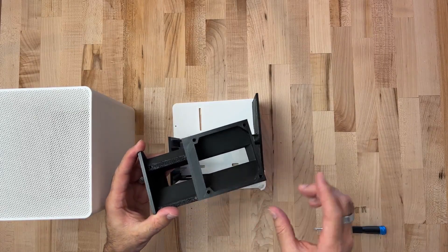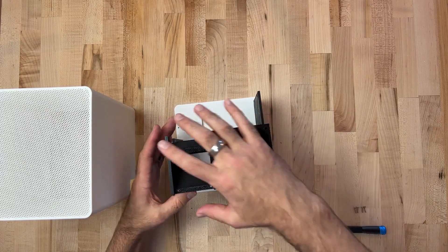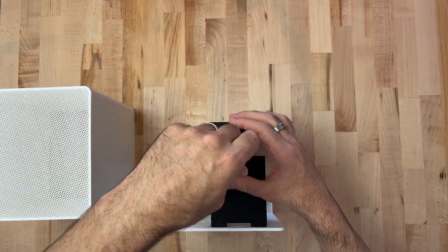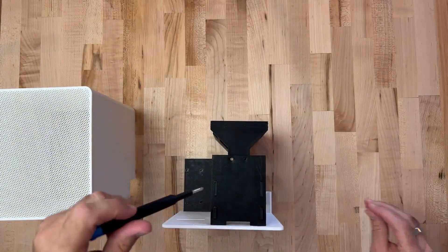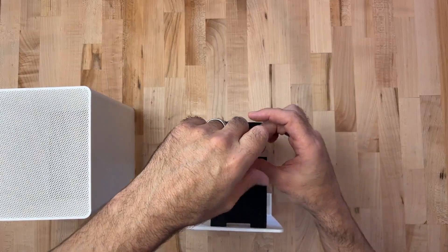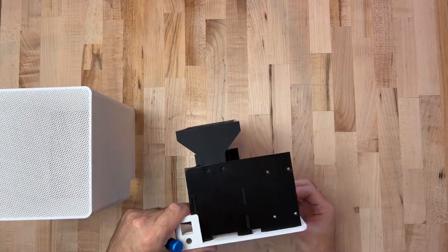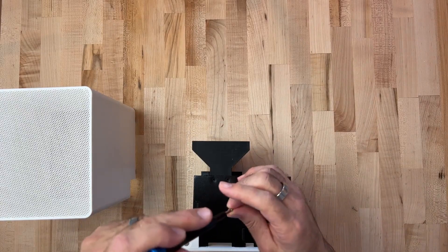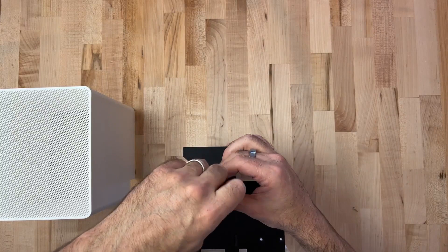Get the fan aligned in there properly so it sits right down in here. This is one of the few places where we're going to use screws — just two screws on each side. I like these brass wood screws for projects like this because they're nice and coarse, so they tend to bite really well on 3D printed plastic. We'll use those there and then two more on the other side. I have links to these in the description below — a nice kit of these screws. You're going to use them for a lot of different 3D printed projects; I find they're really handy.